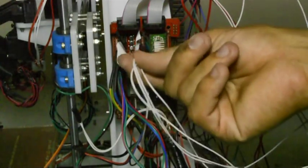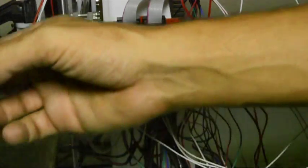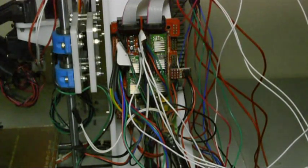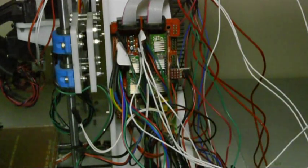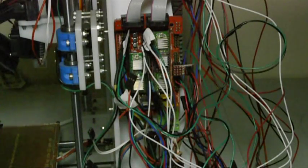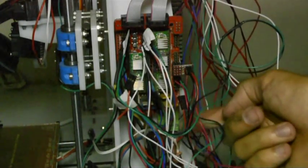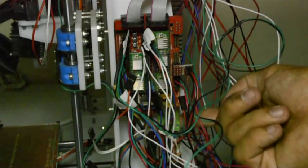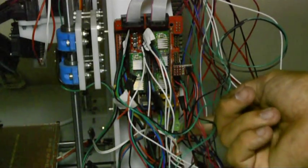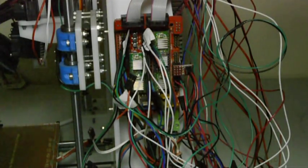Now that the new thermistors are connected, if you have an auto bed leveling kit remember to connect the Z-switch and servo to the RAMPS board in exactly the same way as before. Now connect the two small 30 millimeter fans on the two hotends — connect both of them in conjunction with the green connector wires from the power supply so that they run at full speed whenever the printer is on. The red wire is 12 volts and the black wire is ground.